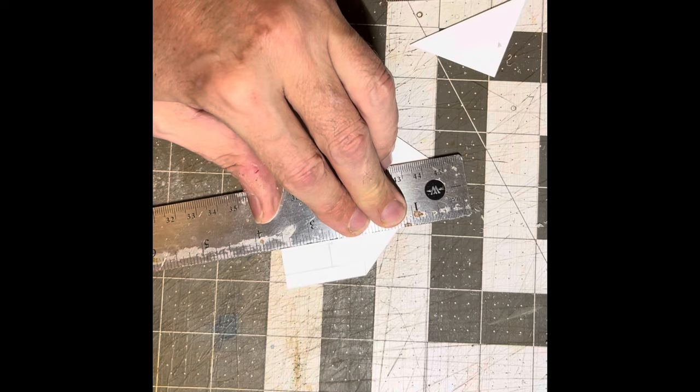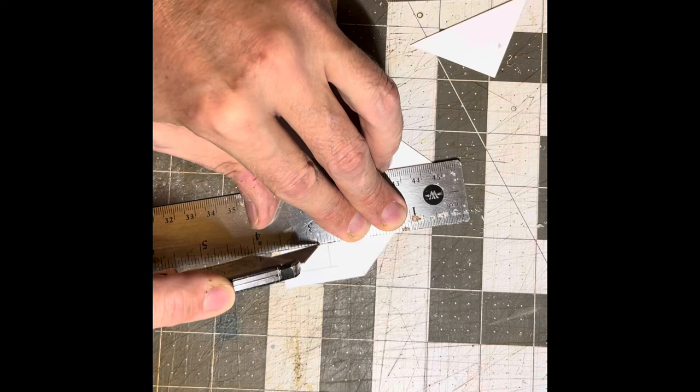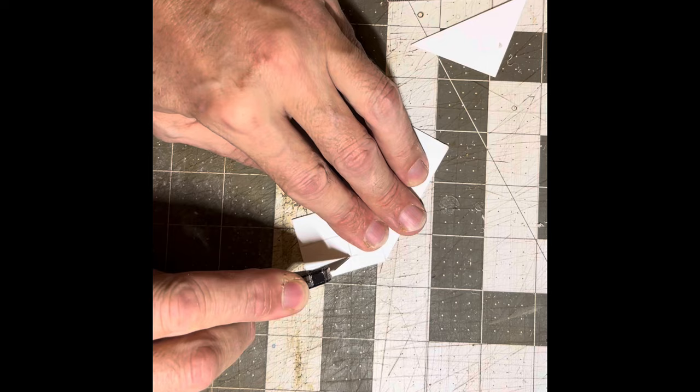Now I'm scoring the lines for the door. What I do is I cut through the left and right side — the vertical cuts — and then the horizontal cut for the top of the door I just score and snap. That usually gives a pretty clean cut.